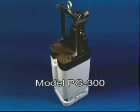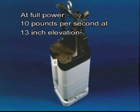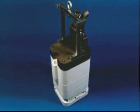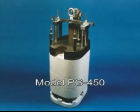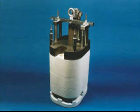The model PG-300 delivers up to 10 pounds per second at 13 inches elevation. This pump draws metal from about 12 inches below the bath surface. The model PG-450 delivers up to 20 pounds per second or 100 inches elevation delivery, and its metal intake is about 16 inches below the bath surface. Both pumps are supplied with metal filtration systems to ensure delivery of metal with the highest possible quality.